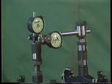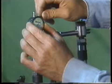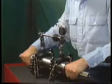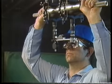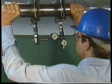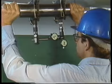With the dial indicators at the 12 o'clock position, the P indicator is adjusted to a zero reading. It's not necessary to take sag readings on the A dial indicator. Now the fixture is rotated to the 6 o'clock position and a reading is taken on the P dial indicator. This reading indicates twice the actual bar sag, because the bar was actually deflected when we had it in the 12 o'clock position. Since we zeroed the dial indicator at that position, we actually negated the sag that was present. So we'll divide the reading by 2 to determine the actual amount of bar sag. In this example, the bar sag is 2 mils.